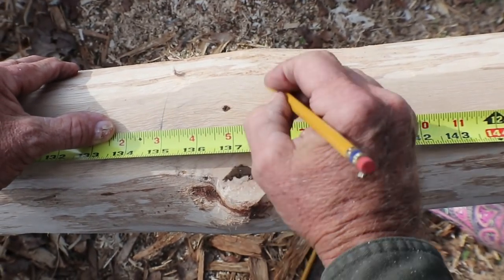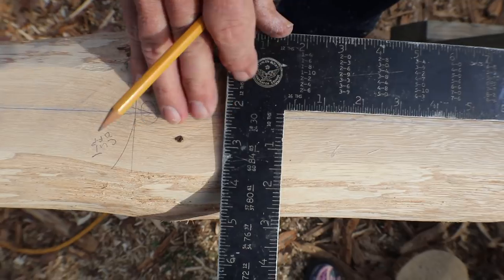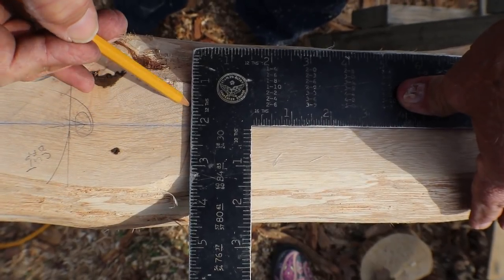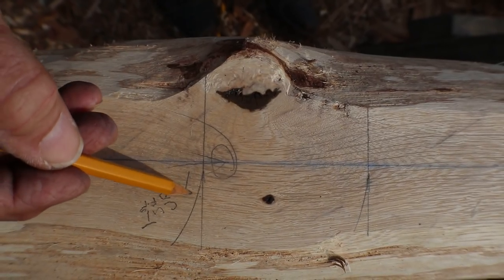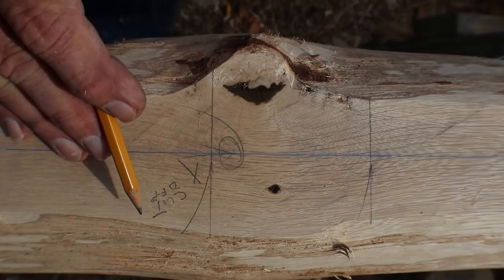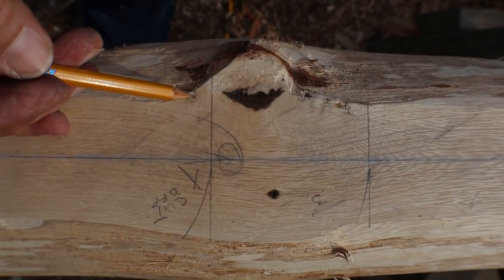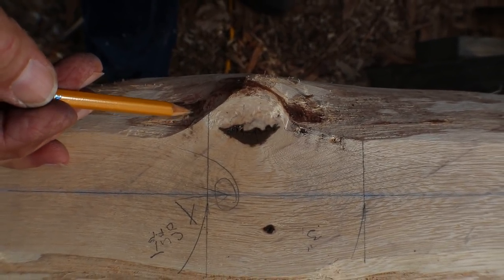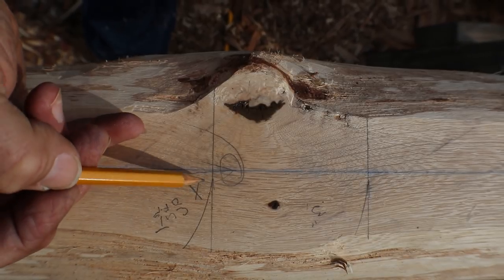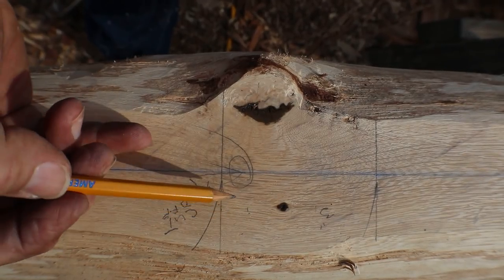Coming back three inches, I'll make a mark and that'll be the shoulder — marked just like I did at the other end with the square. I'm going to go ahead and mark my shoulder while I'm at it. I'm going to take my chainsaw and cut this off on this side of the line. This will be the actual end of the joist, which is eleven foot six, and we'll have three inches that will pocket into the sill log. Since this cabin is twelve foot wide, the actual inside dimension is eleven feet, so eleven six will be the total length of the joist with three inches pocketed on either end into the sill log.